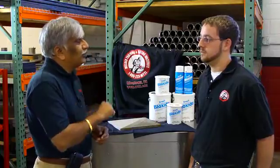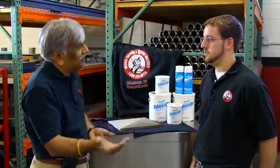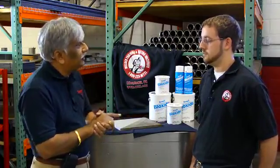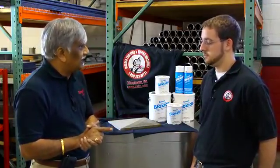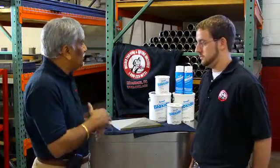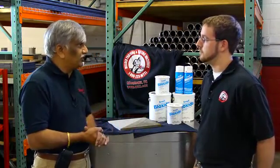You can actually weld on the coating without generating hazardous fumes or bad odor, which is normally generated by welding on other rust preventive products that are zinc-based. The main important feature is that since it's aluminum-based, when aluminum goes into the weld metal it acts as a scavenger, because it has more affinity for oxides and oxygen. It combines with oxygen and oxides and goes into the slag, creating an x-ray quality weld without leaving any inclusion or porosity.